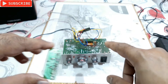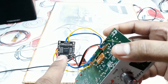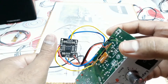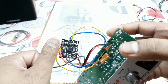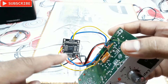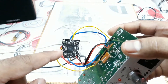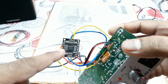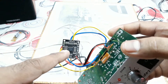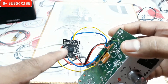That's what I want to show you. You can see that's a PAM8610 amplifier kit — it's a very tiny one, much smaller than the original. But this thing delivers 15 watts per channel, which is much more output. You can drive it at 12 volts; you can give it more than that, but 12 volts is the ideal power supply for this kit.